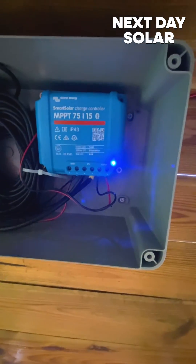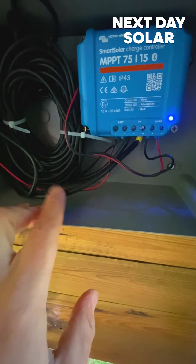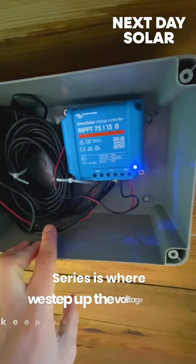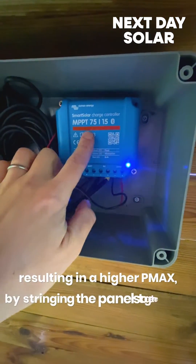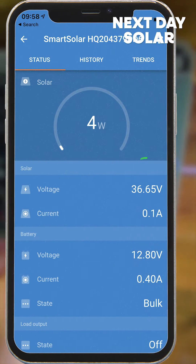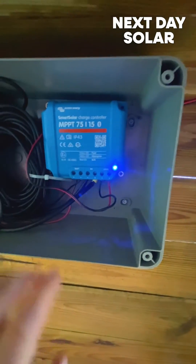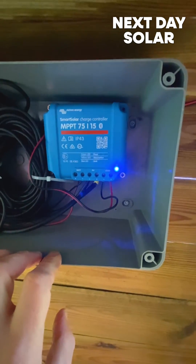It's currently on. I've connected my solar panels — positive and negative — which are these two thick cables here. I've got two panels on the roof wired in series. With an open circuit voltage of around 18 volts for each panel, my maximum voltage input would be around 36 volts. So 75 volts is more than enough for the sunniest day in the UK. I've got a 24 amp hour, 12 volt lithium battery connected, and with the 15 amp rating there's plenty of current that can be pushed into the battery if needed.